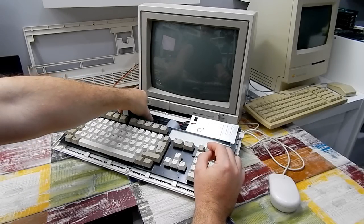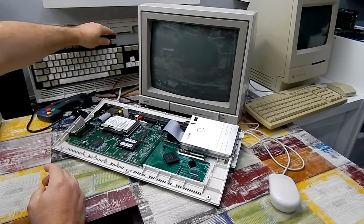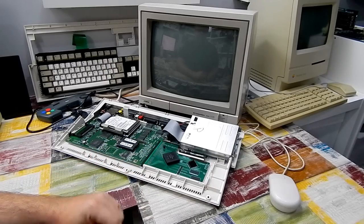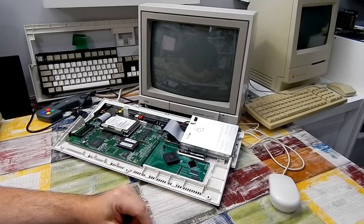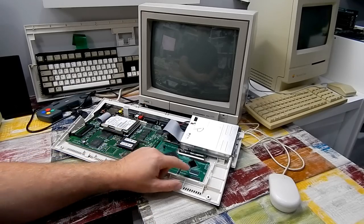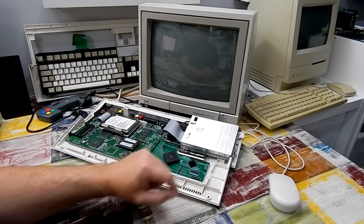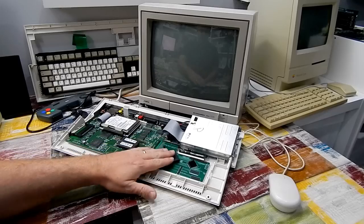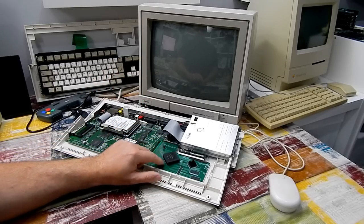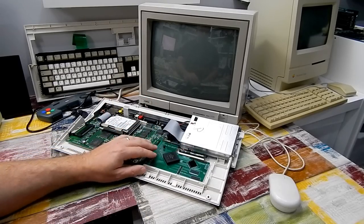Yes, my Amiga 1200 is in bits again, but with good cause. Because do you remember a couple of weeks ago when we built this accelerator, the Terrible Fire TF1230, this fantastic piece of kit, a 68030 accelerator with 64 megabytes of RAM? You can fit 128 on these, but mine just has 64 megs of RAM. The chip is clocked at 50 megahertz, although we were able to push it out to 60 with a bit of an overclock. But here's a question: what's missing from this picture?